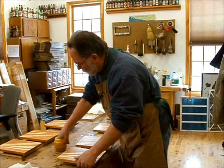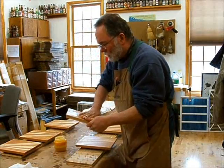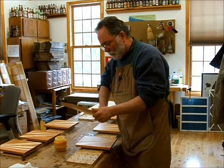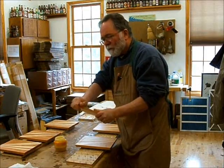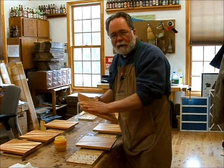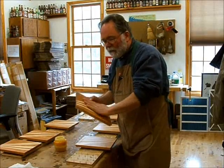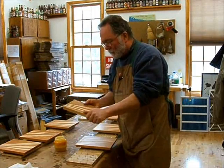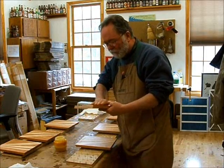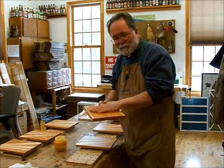You mix up the boiled linseed oil and the tung oil, and then you heat it in a water bath and sprinkle in some shredded beeswax and let it dissolve. And I can't tell you how much. You just do it until it feels kind of like thin honey, and you'll probably be okay. If you get too much, it kind of solidifies and you have to go back to the drawing board, but it's just the way it is.